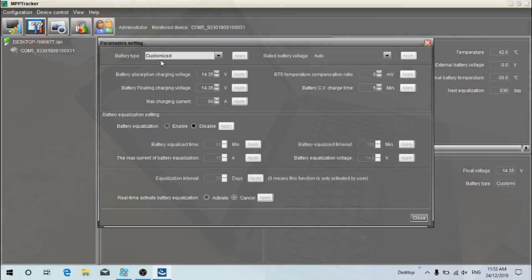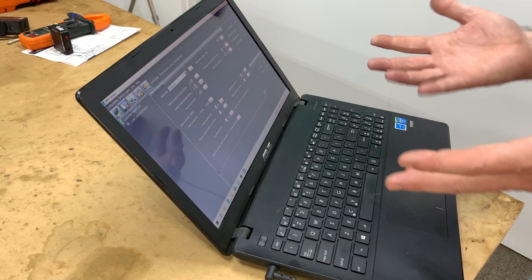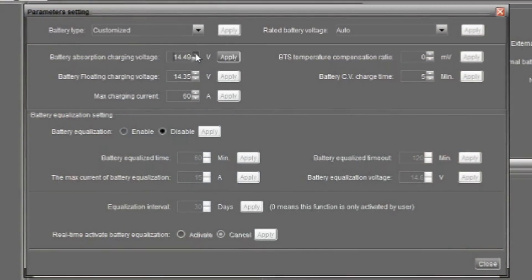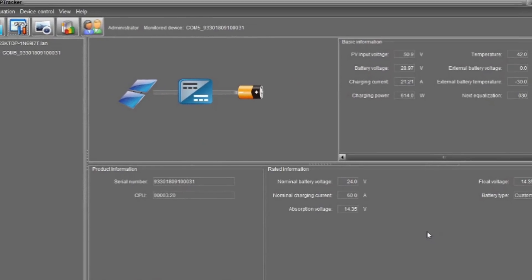Click on tools. Now our MPP tracker and the PCM60X is in 12 volt increments, so 14.35 volts equals 4.1 volts per cell. Now we want to take that up to 14.7 volts, which will give us 29.4 volts as top of charge. So we have to change the battery absorption charging voltage to 14.7 and also the battery floating charge to 14.7 as well. Now you should never take this lightly — cranking your lithium-ion batteries up to 100%. I've got battery equalization set to disable, then we click close. That'll send those settings up to the actual inverter itself and it'll start charging.